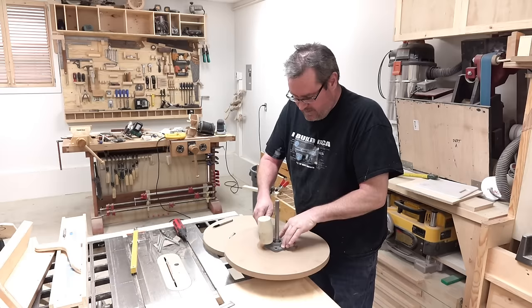I did it on my bandsaw, it's holding up well. It's easy. All you need to do is tube it on like this and then spread it on with your finger. Reasonably evenly, it doesn't have to be super smooth because it does compress. And I'm just going to take my finger and smooth it out. It was a couple days later, I let the silicone dry, I put the blade back on, I tensioned it up, it's pretty good. And now I'm getting ready to attach the legs, cut those out of a used 2x4.